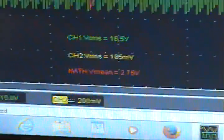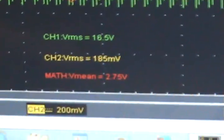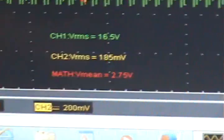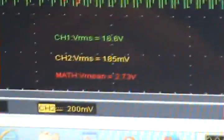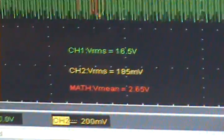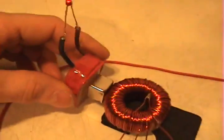The LED is still lit. If we remove the LED and look at our data, there is still zero change — we're still at 2.7 volts positive. Now I'm just adding the LED back with my fingers. The LED has been added and you see zero change there, exactly the same. It's like there is zero effect whether that LED is there or not.